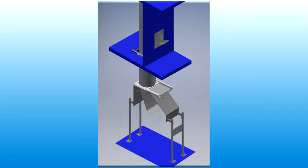Internal to the sorter equipment, a diverter mechanism routes waste from the top inlet into two different directions. Controlling the diverter plate position separates the waste stream between the two outlets on the bottom of the chamber.